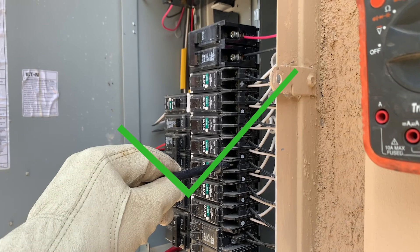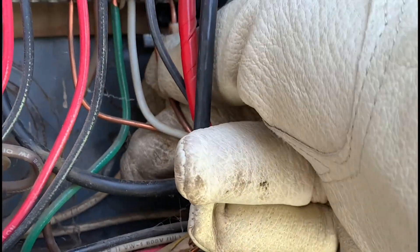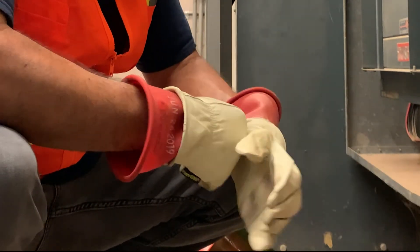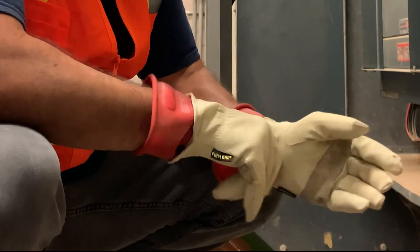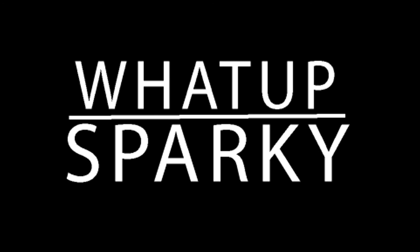This is a situation I see a lot of people not practicing, and it is very good practice. We're not talking about arc flash, but you would get arc flash protection from these gloves with the leather protectors on them — just something to note. The same Restricted Approach Boundary applies in commercial and industrial situations from 151 to 750 volts. The shock factor is the same. That's it for Restricted Approach Boundary — I hope you've learned something. I challenge you to see what your company's best practices are, and maybe you can do even better than the table. Be safe out there!